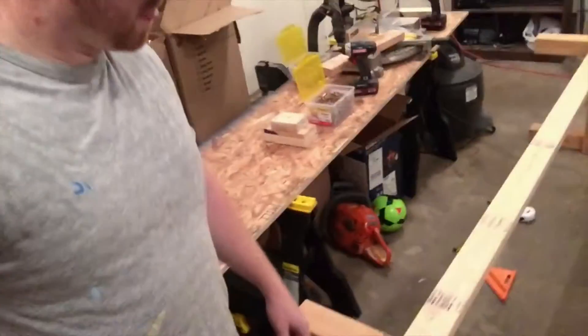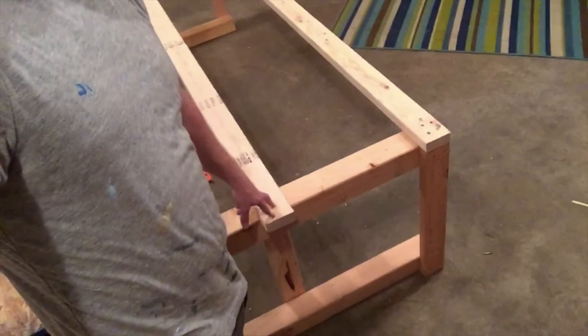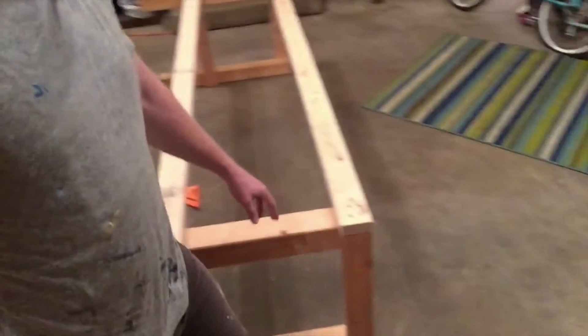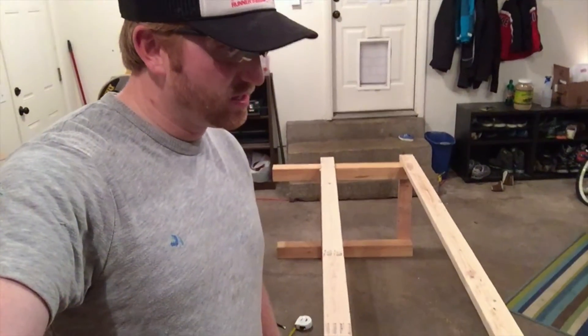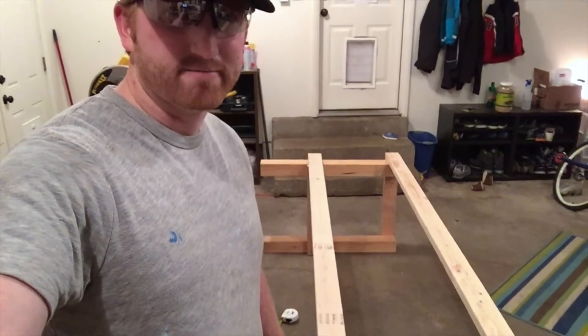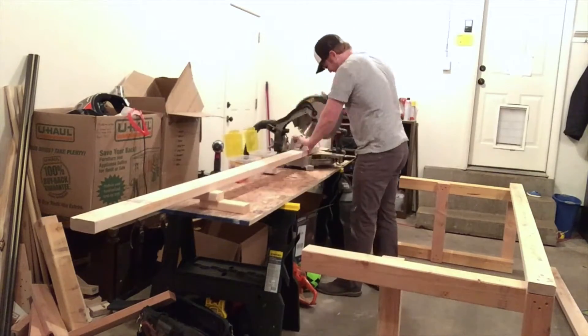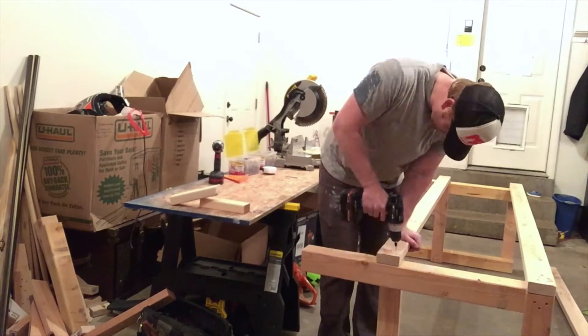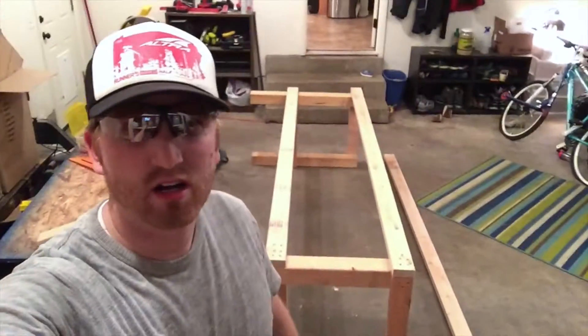I'm making this up as I go, but I want to lay this just in line with the others — bottoms at 12 inches. Because these were set to the outside and the others to the inside, I now have an extra 3 inches on one end. So I'm going to cut down two standard 8-foot studs to 7 feet 9 inches. Got one side done, on to the next.